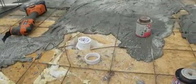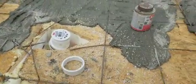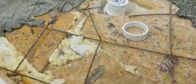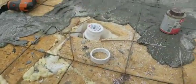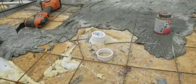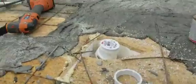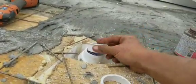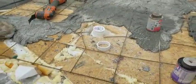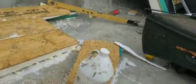So step one is complete. I cut the pipe as low as I could after widening the hole, and then it was still a little bit tall after I cemented the thing on, so then I cut this much off of the connector that was up at the top. So now it's basically down to a low enough level. Though, because this has been trimmed, that doesn't sit flush, but I can always make that work later on. So it's not perfect, but that's all set. And now just for all this foam project.